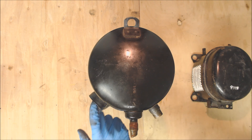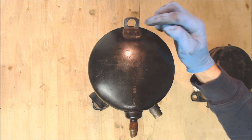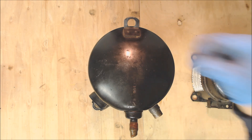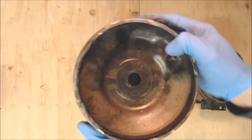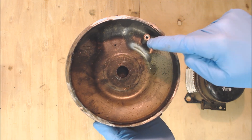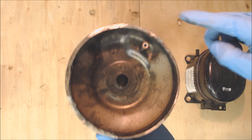The electrical compartment is right over here on the scroll compressors, and you see this bracket right here — that's actually for attaching a c-clip or a chain onto it, and then hoisting the compressor in or out of the actual unit. So here you have your scroll compressor, and this is your discharge tube — this is where the discharge goes into. And this is the internal pressure relief if it has to take the high pressure and lift it back into the low pressure area.